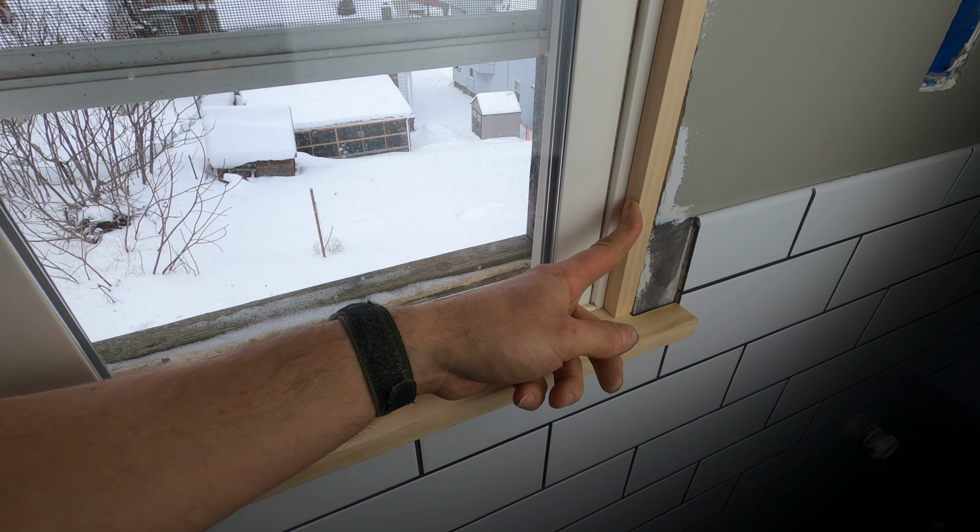If you're a diehard woodworker and you want to have fresh on hand all the time, you can do this. You can buy these shellac chips and then add some ethanol to it. This is about a quarter pound here, so you'd add about, I think, a quart of ethanol to it, and then you mix it up in a can, and then it's ready to go, just like this stuff.